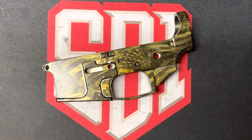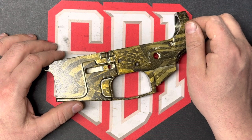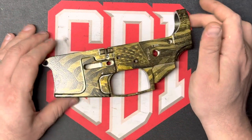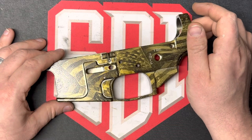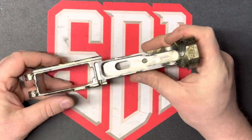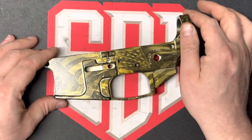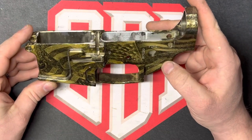I will say that doing a hydro dip is a lot more involved than it appeared in the videos. There's just a lot of timing between getting the base coats down, getting the water heated up, getting the film cut and spaced, getting the tape down for the borders, getting it dipped, 1 minute in the water, 20 seconds for the activator, and then racing inside so that I could wash off the film after I dipped it. It's a really involved process.